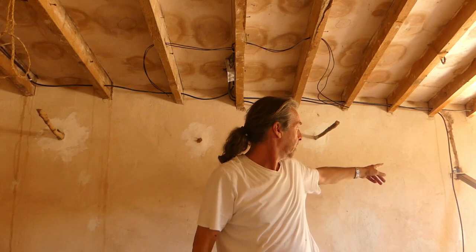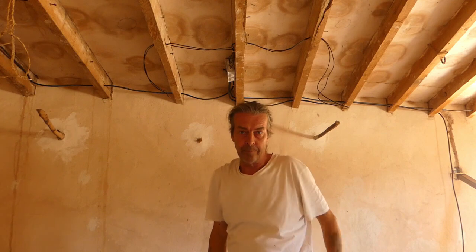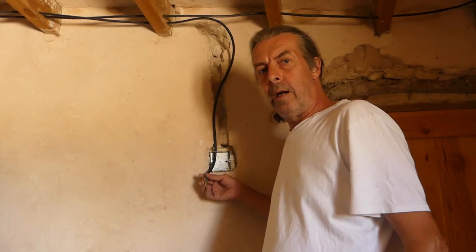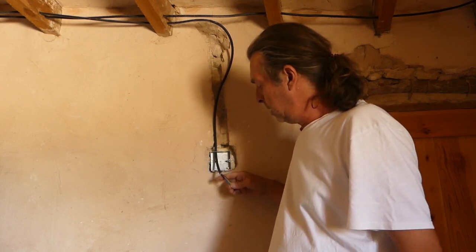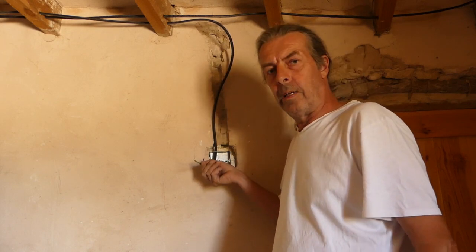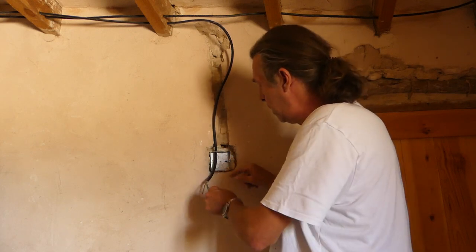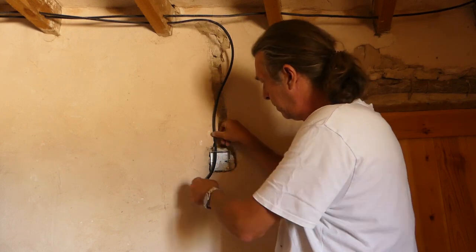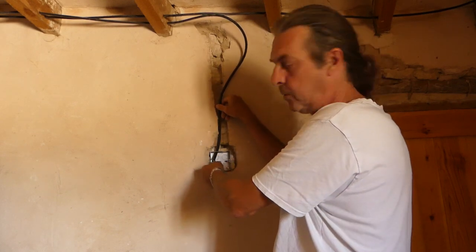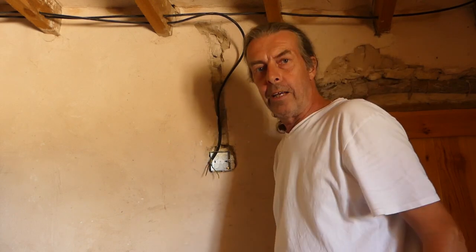The switch wire's in. I'm going to have a look at that in a minute, see if my box has set yet. Right, so my wire's in — you can see those. I've cut them to different lengths because that one will go in the top connector on the switch, that one in the bottom connector, and the earth I'm going to earth to the box there. It's a bit long, but it's better to have it too long than too short — you can't add any on. So I'll get the switch wired up.